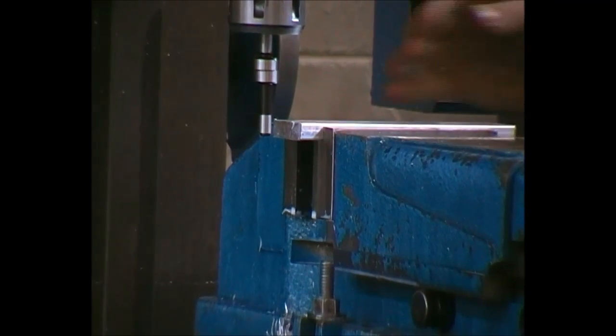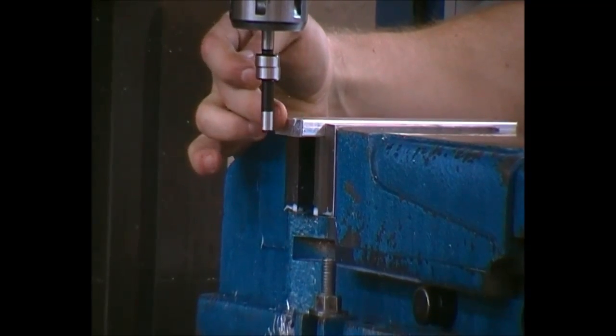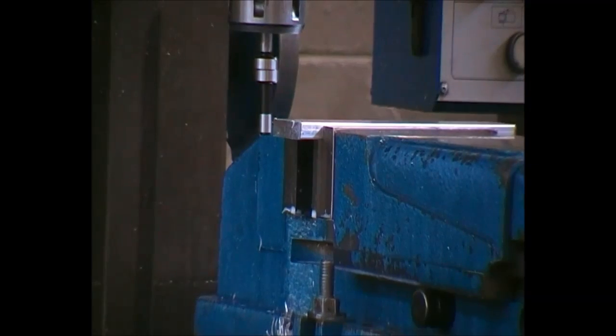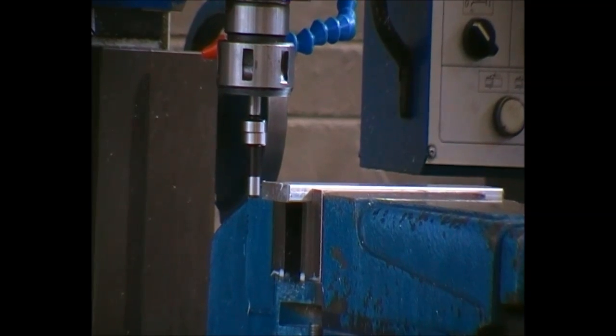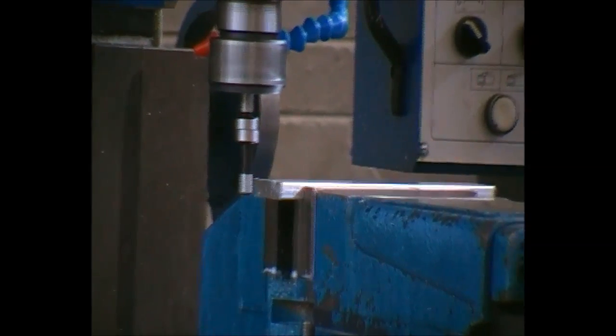You will note the wobbler has a thicker end and a thinner end — please make sure the area touching the part is definitely the thicker end. In this instance it is 10 millimeters, which does come into importance as explained later. Never use automatic feeding with a wobbler — only use hand feeding.